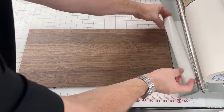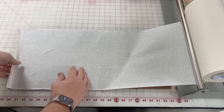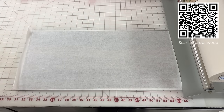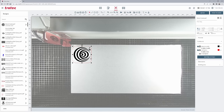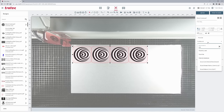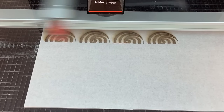The process for wood is slightly different because any liquid will permeate the wood grain, causing bleeding. To combat bleeding into the wood, there are some necessary additional steps. Start by first masking the wood — this step is not entirely necessary, but will save on sanding later. Once masked, place the wood into the laser, open the Ruby software, and place the desired graphic into Ruby. In this example, I will process this coaster design and duplicate it to make a set of four. I will choose skip overlapping cut lines, select the walnut wood material parameter, adjusting the speed to apply a fair amount of depth, or set the laser to engrave two passes. Push the file to the laser, then engrave and cut the design into this masked solid walnut wood.